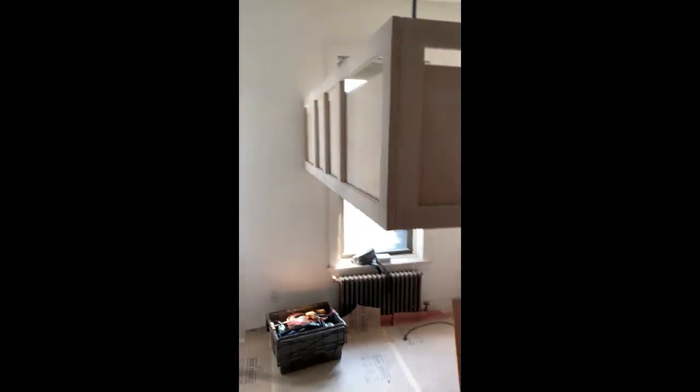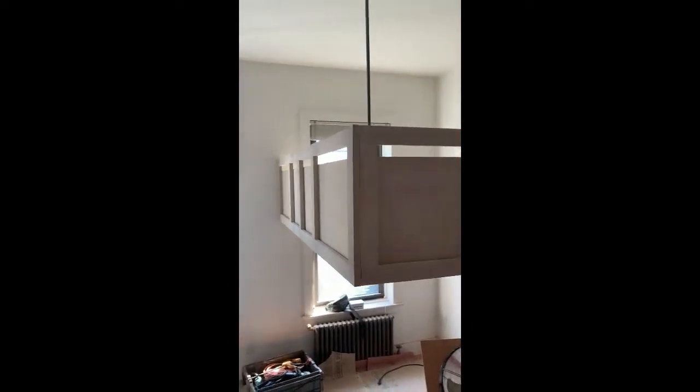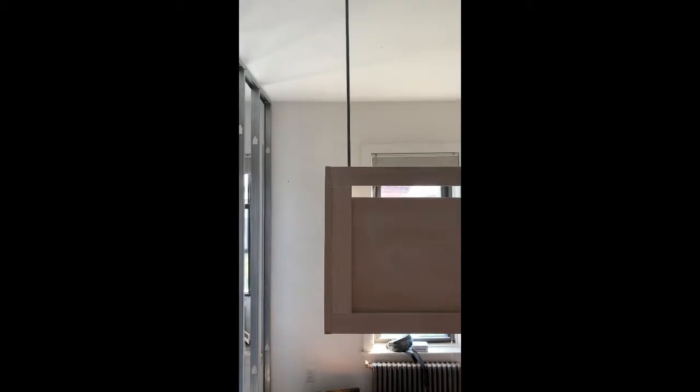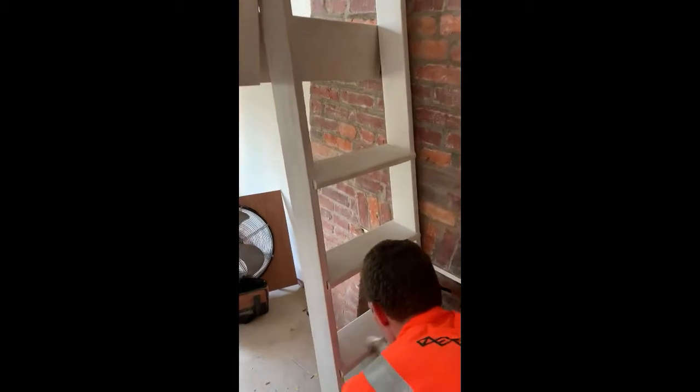This has got kind of a semi-distressed whitewash finish on a birch ply. And we fixed that threaded rod so that it's perfectly plumb up and down. Brian is putting on a clear coat on the ship's ladder. We always do ship ladders with dados so that there's a notch in there — a little notch so it's really strong and the steps won't move anywhere. And we always make little handles; it's ergonomic. You can look up here — there's the loft. Lovely birch floor.